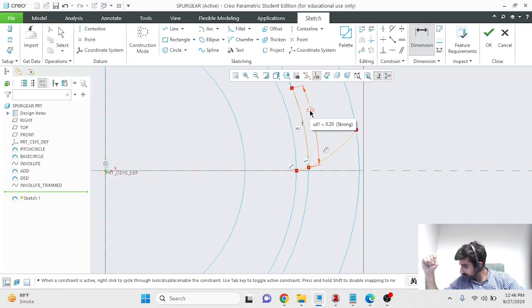I hope that's all right. Let me just verify that very quickly. So the thickness will be pi over 16. Yeah, so that is 0.196. But instead of making the entire arc, I'll only make half of it. So 0.196 divided by 2, which after some truncation is around 0.1.